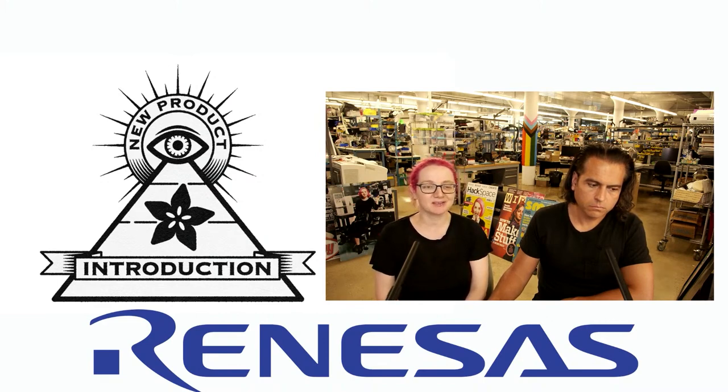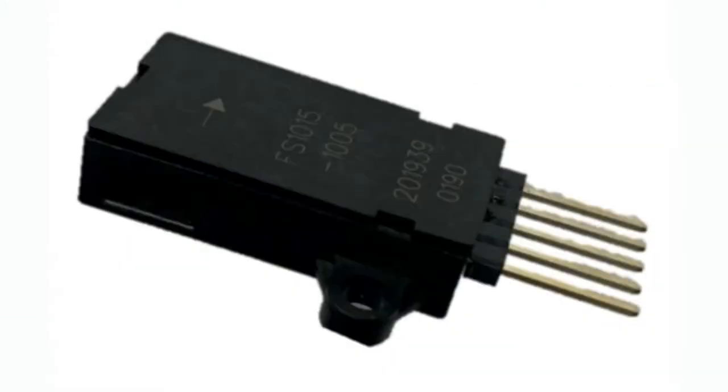They make a whole bunch of products. So when this sensor popped up — and you know me, I love sensors — this is the FS1015. It is an airflow velocity sensor. It comes in this package. There's basically a slot in the sensor. It's kind of an all-in-one module. There's a slot, and you can blow air through it up to 15 meters per second, which I looked up — it's 30 miles per hour. And it will generate a signal for you and allow you to measure it.